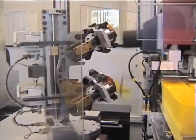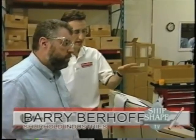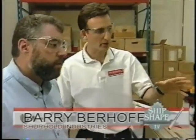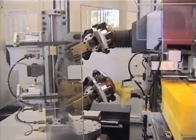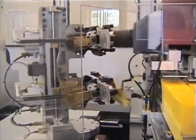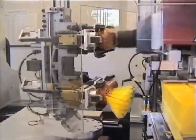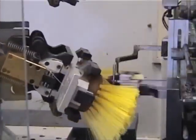Barry, talk to me about this machine. What's going on here? What you're seeing here is an actual deck brush being made. This is our 10-inch brush, and these are staple set brushes, which means the filament is held in the hole by a staple. The machine runs in tandem — both sides run together. Both platforms move at the same angle, so hole number one is drilled on the A side at the same time that hole number one on the B side is filled.